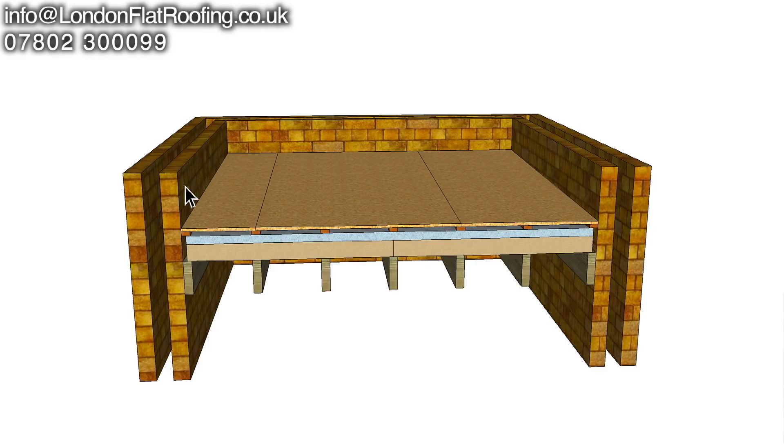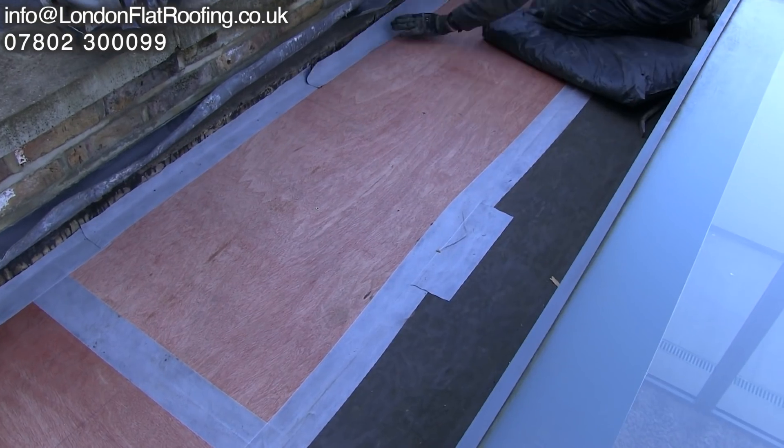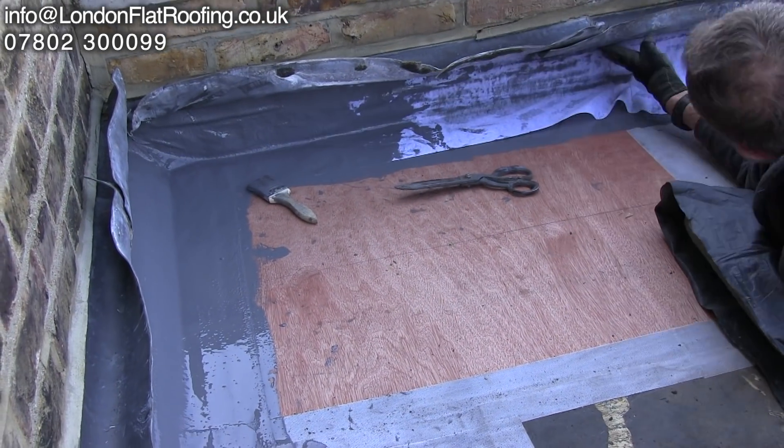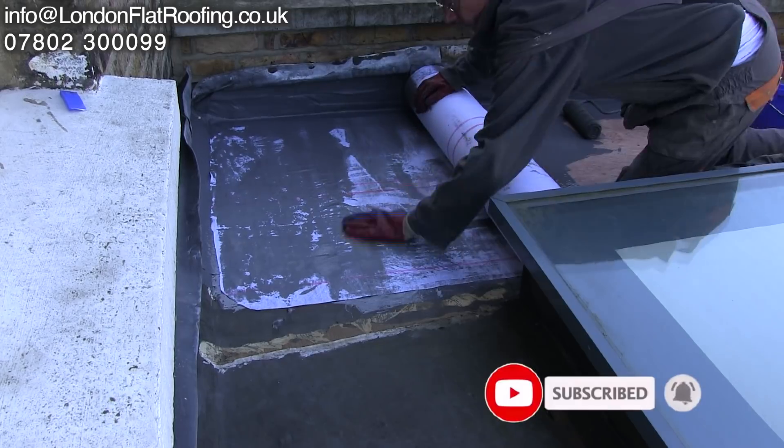On this particular roof we're going to change the coping stones. We're also going to add vents wherever we can all over this roof, and in some places we're going to put a long vent across the walls, because one long vent will cover more of these cavities than individual mushroom vents — and it will look better and be much better design. We're going to do as much as we can to vent the roof so that it doesn't sweat in the future, and that's the best we can do without stripping it all back and putting a vapour barrier in all the way around. We had to get the work finished in a day and get it waterproof, so we're putting our waterproofing system over the top until we come back and put all the venting in. Don't forget to subscribe if you want to see how we finish it off and what we do with the venting.